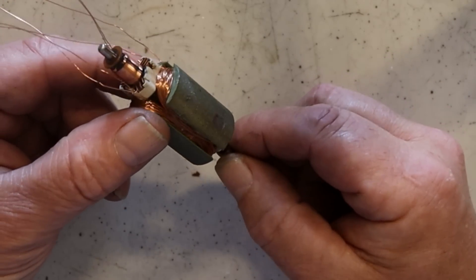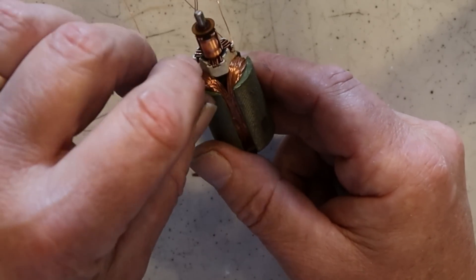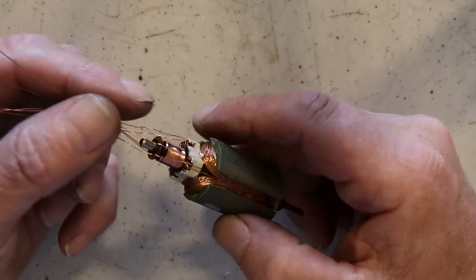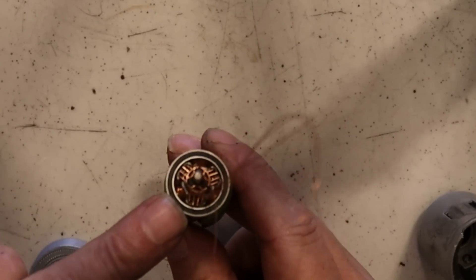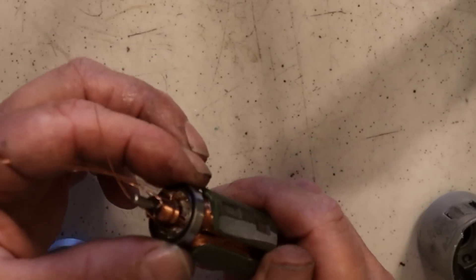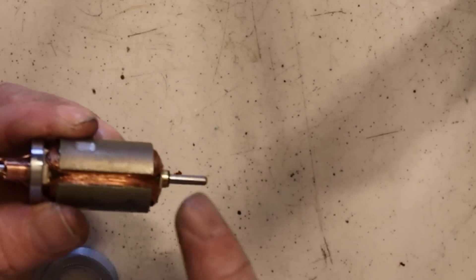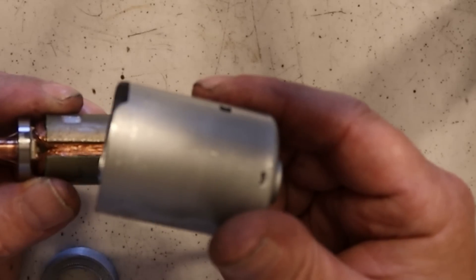Now I've got 150 turns of thinner wire on. I have a choice here — if I'd taken the coil straight over and soldered on I would have made it into a brushed DC generator, but I want to do something different. Over the commutator I've fitted a large bearing, 21mm by 15mm, and that means instead of turning the inner part as before, if we fit the body over it, the body will be able to turn while this stays still. So this becomes the stator and this becomes the rotor.